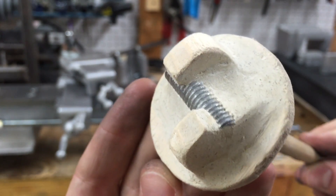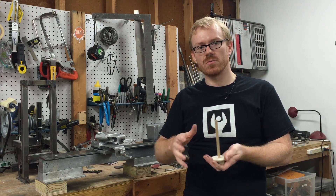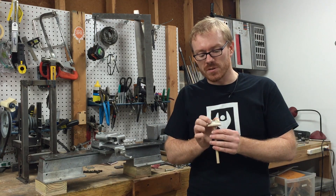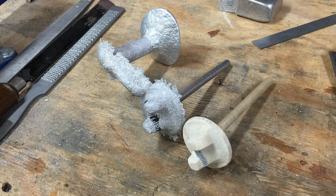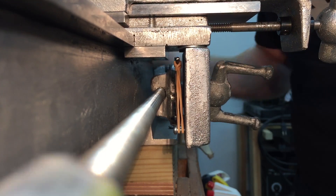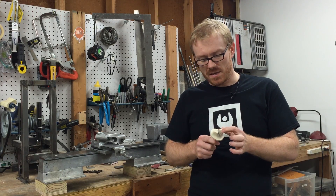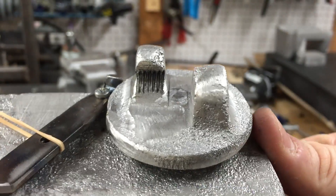For casting the split nut, you use not only a rod inserted into the cope — that's the top part of the mold — but you also cut a short segment of threaded rod to fit down into the pattern. When you pour the metal into the mold cavity, the threaded rod is cast into the split nut. I just used a hacksaw, cut and filed the split nut down until I was able to knock out the steel threaded rod, and that left really nice threads in the split nut.